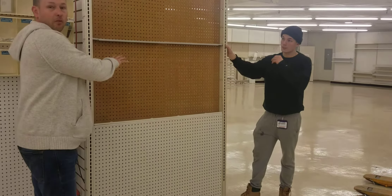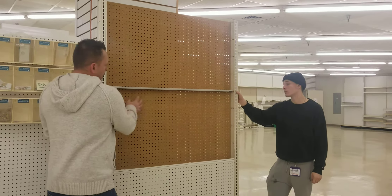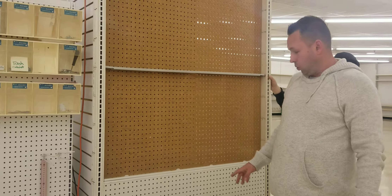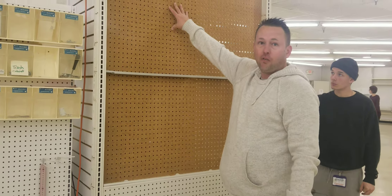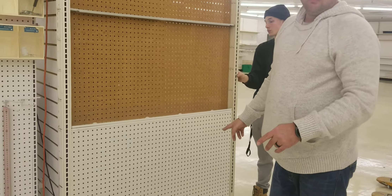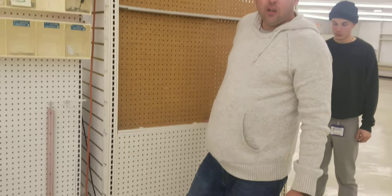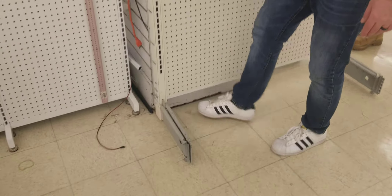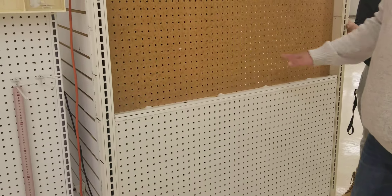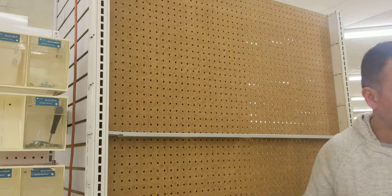Then once you have this backer panel on, before you put the front panel on, go ahead and take your drill and a few more screws. In total you should probably have about six to eight screws running through this backer panel into your manufacturing racks to make sure this is secure. One thing I didn't mention — before you start fastening into the panels, you're going to want to do some fine adjustments to the leveling legs on the base brackets on the uprights to make sure that this is sitting level, not just level this way, but plumb to the manufacturing racks before you start fastening.